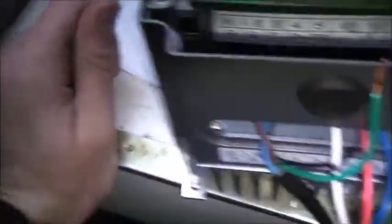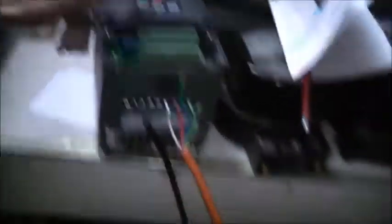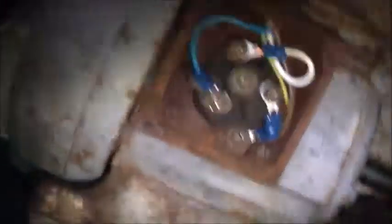If you short those three out, don't touch these either because the VFD still has charge and they will kick you up the arse. I unplugged it, then I pressed the run button and it went to run the motor and discharged most of its residual power. I always press the run button after a VFD is de-energized - it's a habit I've got to try and get any residual power out of them. I think that should be okay. Need some help with this one - there's no information on delta or star on this little motor. It's very weird - no marking in there, nothing. Just blank.